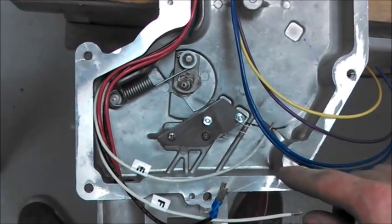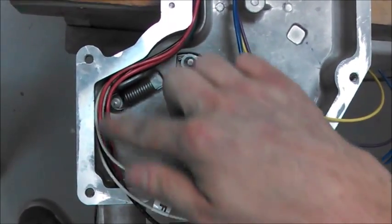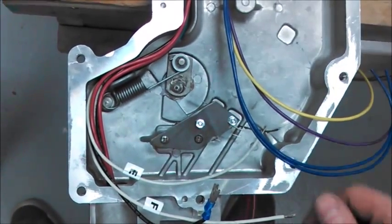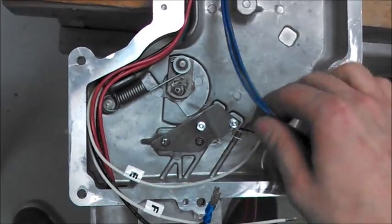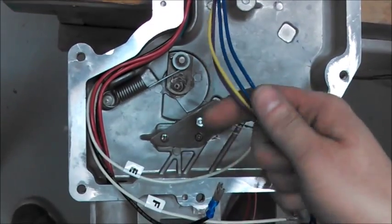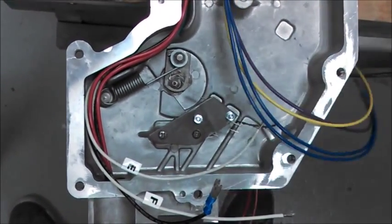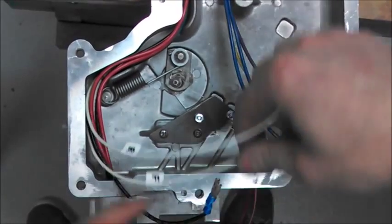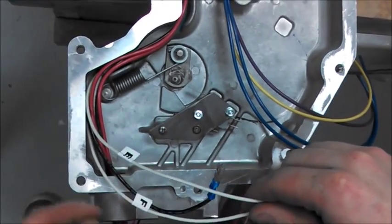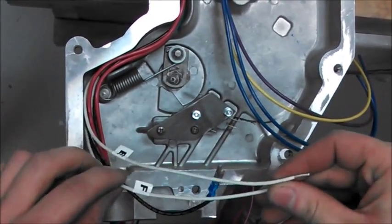This step picks up after you've already pulled your eight wires from the junction box through the reset assembly, in the chase here and up into the top of the dispenser. You've already fished down the two blues, yellow and violet wires that come from the wiring harness from the CPU. The E and F wires have been marked coming from your valve assembly — E being your slow flow, F being your fast flow.